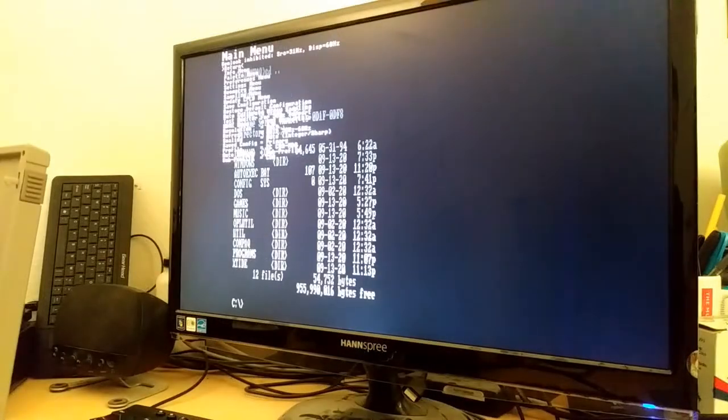All right, I just got it to work. I spent like half an hour just looking over the wiring, making sure I didn't make any mistakes. I couldn't see anything wrong. So I just looked online to see if there was some way I could activate the external monitor on this LTE laptop. There's nothing on the keyboard that would suggest that you would have to enable the external monitor, but apparently you press Control Alt and the little left arrow symbol. And I found that on some obscure website.